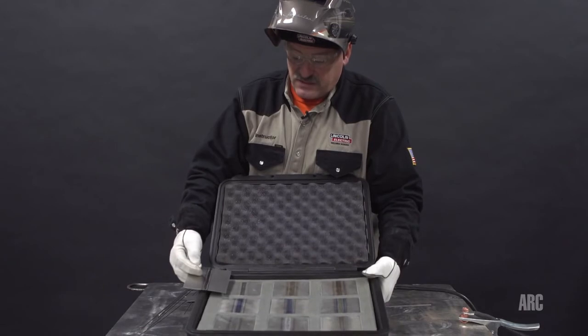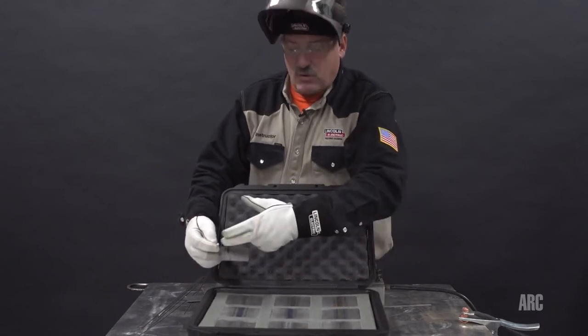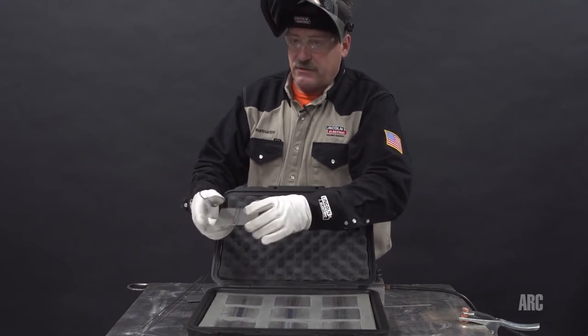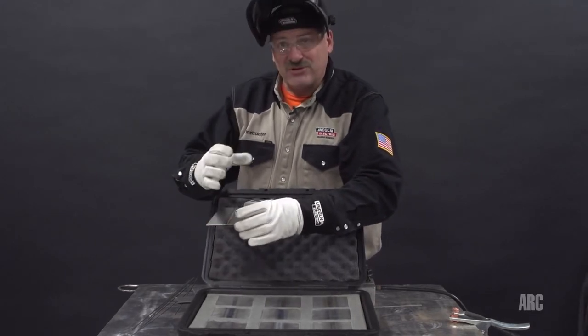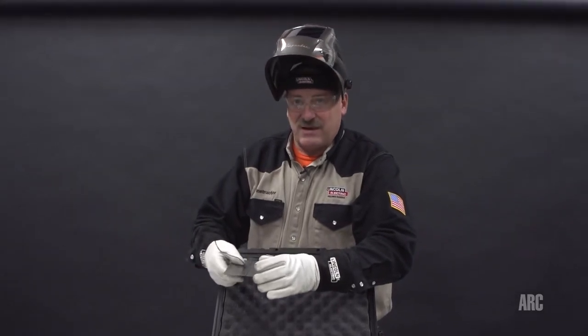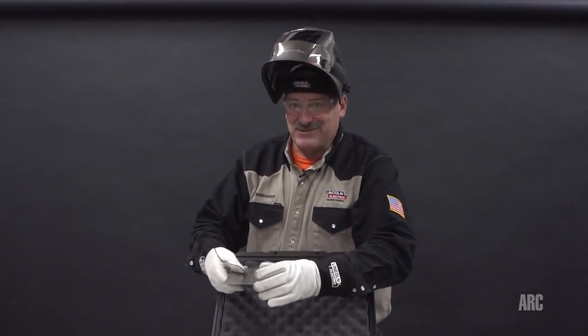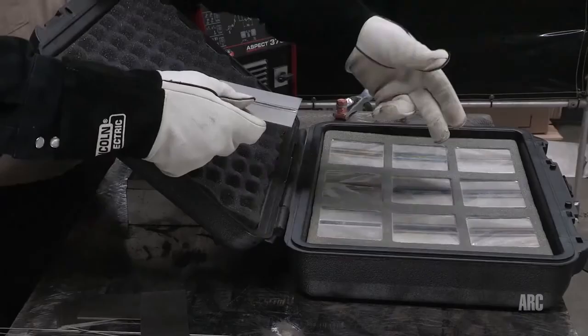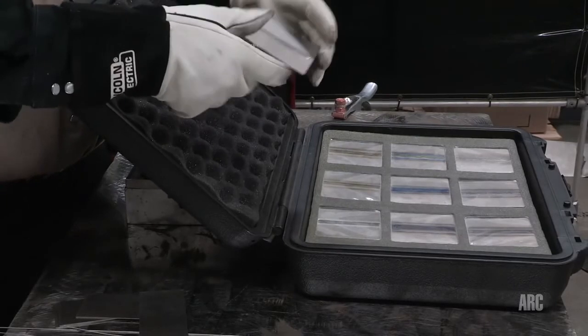Now, if the titanium gets exposed to heat after welding by not using a trailing cup and there's discoloration, chances are it didn't hurt the weld that much as long as there was good shielding during the weld. But the inspector that inspects titanium welds doesn't know how it got exposed. So if they see blue or dark golds or blues or purples or white, the part is rejected.